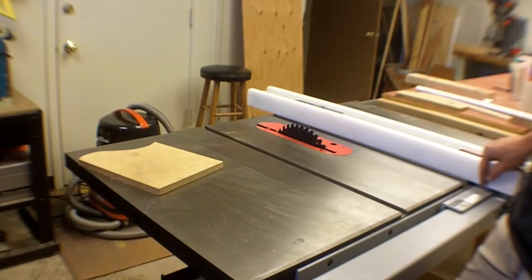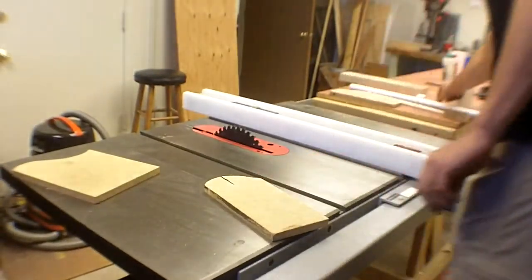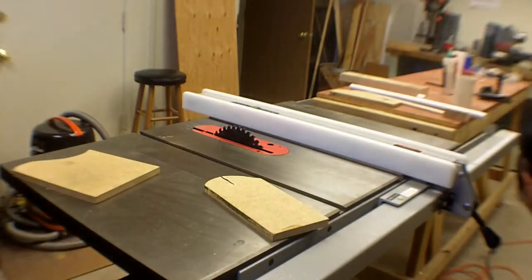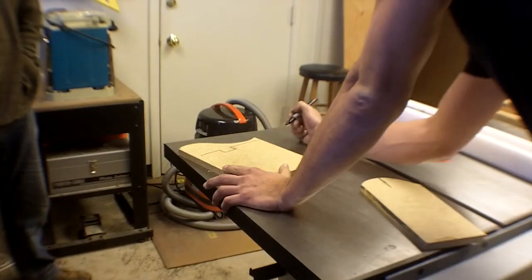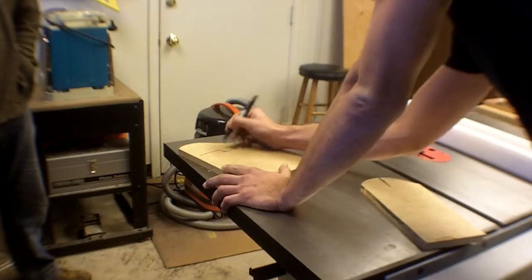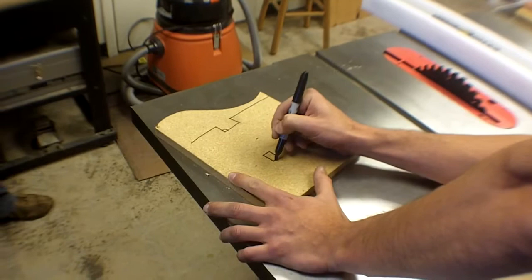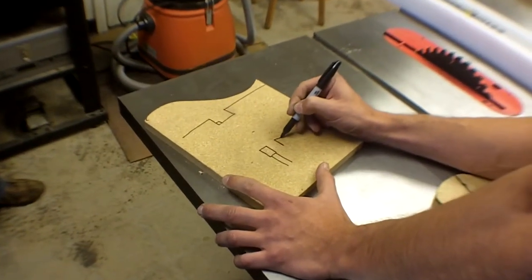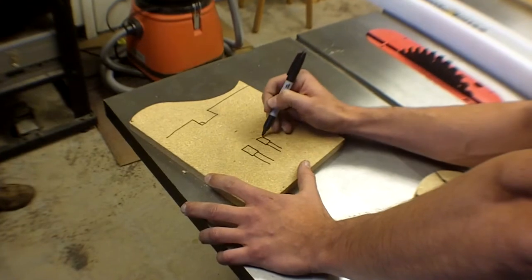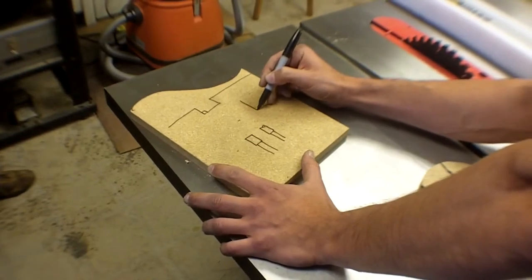You can use this saw to make grooves. A square-cut-bottom groove requires a tooth profile where the carbide tip is flat. Most modern table saw blades have alternating tooth profiles — one tooth angles one way, the next angles the other. So the bottom of most cuts you get will actually look slightly scalloped when zoomed way in. You can actually see the alternating tooth pitch if you look at the blade.